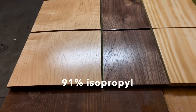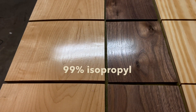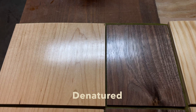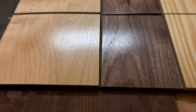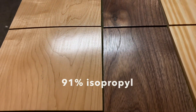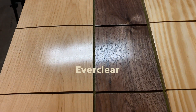For the maple and the walnut on day three, I put three more coats of the 3 quarter pound cut shellac on each piece, bringing the total up to 19. Just before doing that I used some steel wool and 600 grit sandpaper to smooth them out. On the last session of the third day, I added three more coats to the maple and walnut boards, bringing the total up to 22 coats. You can see they are looking more and more similar to each other as the number of coats increases, similar to the 2 pound cut mixtures on the pine boards.